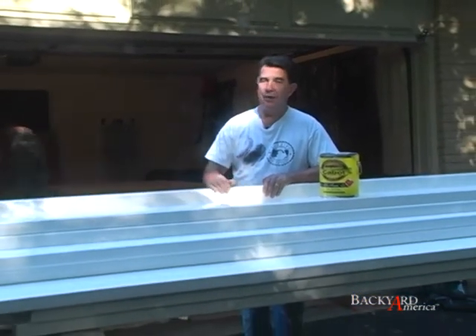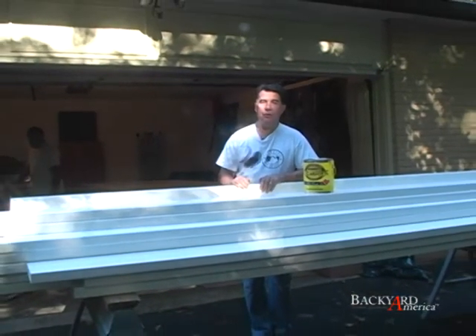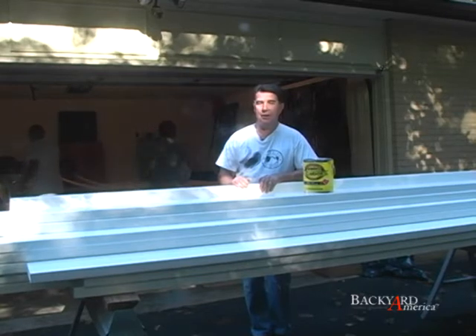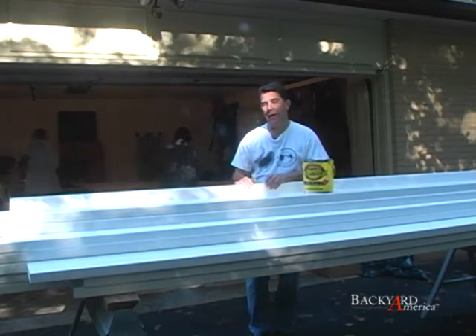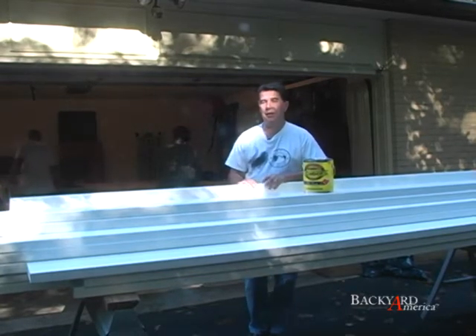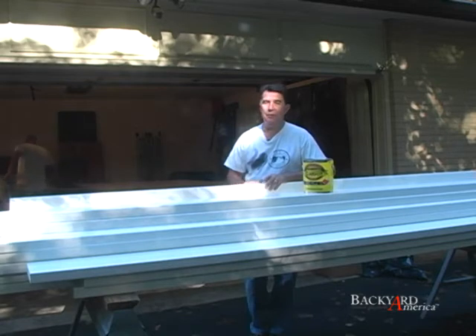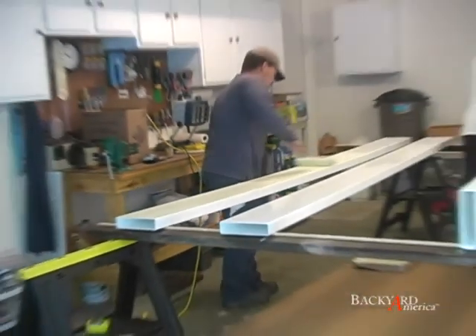The application takes two coats. Each coat takes 24 hours to really dry well, to turn it over to get the other sides. If you don't do that, what happens is that it will begin sticking, and then you have areas on the vinyl that are hard to make smooth. One of the beauties too is to use a 3/16th inch nap foam roller.